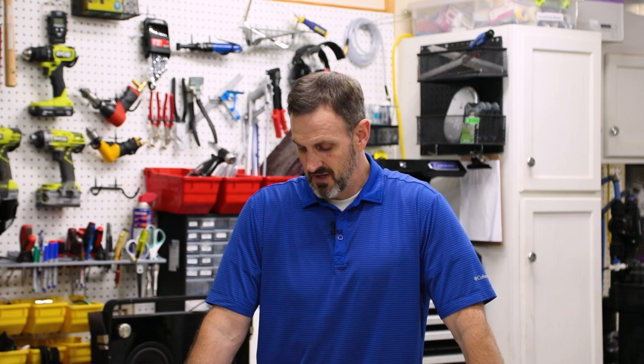Another mistake I made is I actually put an extra hole in the rudder skin or vertical stabilizer skin when I was using the pneumatic squeezer to dimple. It's really close to where the dimple hole was supposed to be. And so that caused a slight panic. I almost decided to just call it quits and go watch old episodes of The Office or something like that. But fortunately I stuck it out, got online and found that, at least the way I screwed up, I can fix it by doing two holes around the hole that's screwed up. And anyway, that's about it.